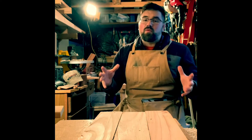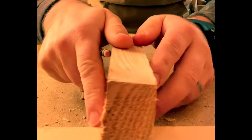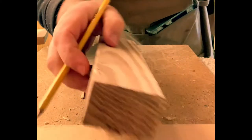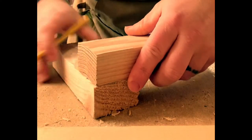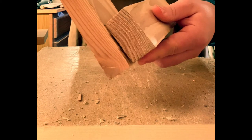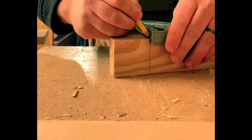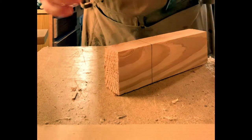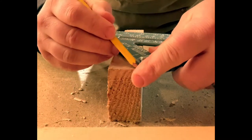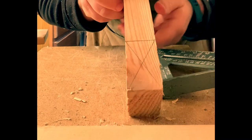The first thing we want to do when making our lap joint is make our rabbet, so we're going to put a rabbet on the end of this board. Basically we're going to divide the end in half and cut a section of that out. The easiest way to do this is to make a mark so that we know where the edge of the lap joint is going to go, then take our speed square or combination square and wrap that up over the top. To find the dead center, we use that corner-to-corner trick — that X point gives us the dead-center line.